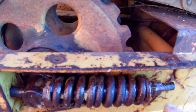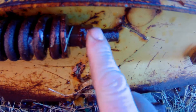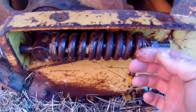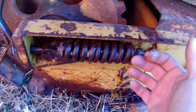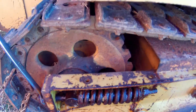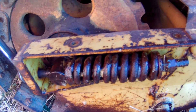Got the tools, I'm gonna get started. There's actually two of these - there's another one I've only seen half of right down in here. What you've got to do to tighten these is get a wrench up here on this one and hold it. There's two nuts - break the back one loose and then take the front one and go round and round and round, keep making that spring tighter, keep compressing it. I've got to do both of them. What that does is it mashes that spring and puts a little more tension on it, and pushes this bolt - this center piece in the middle of the sprocket - forward. I'll get them both done and show you the end results.